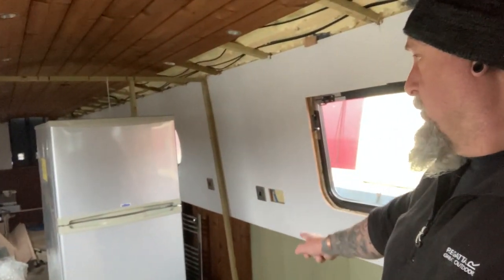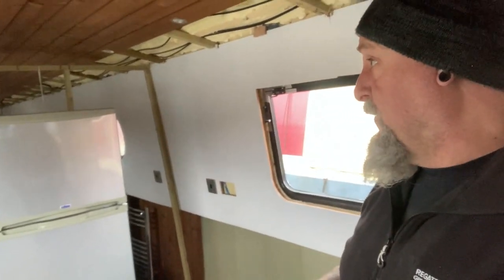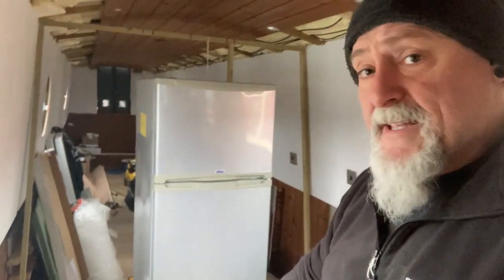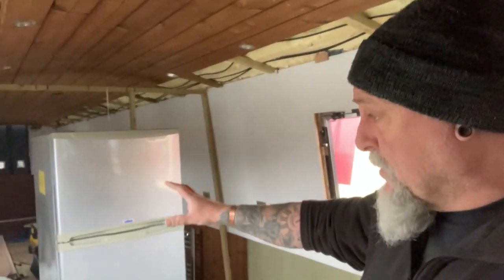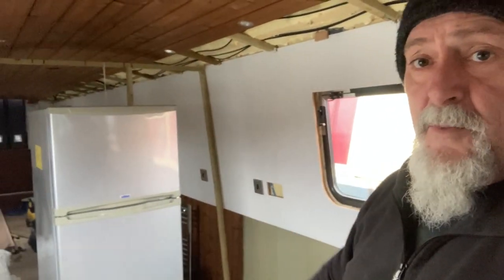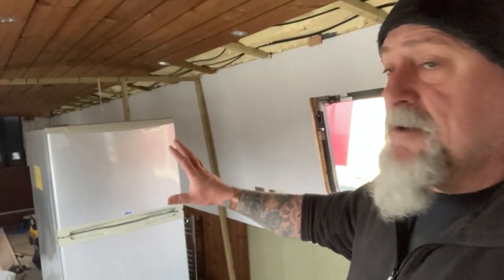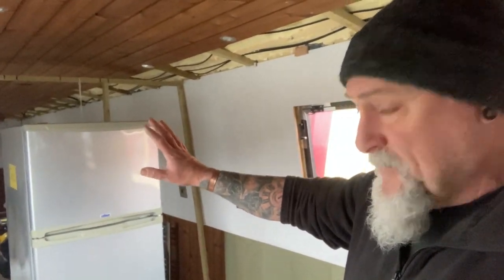stud this bathroom, kitchen bulkhead in. And again, if we remember what we just talked about, there's going to be a cupboard above the fridge, all the way down there. You won't see this side. The cupboards and the cupboard backs will be in front of that. So what I'm going to do, because I've got so many lengths of ply left, I'm going to panel that with that ply, waste not, want not. And then that will give me something to screw to and finish that off ready for the kitchen units. I think it's probably March before we get them.